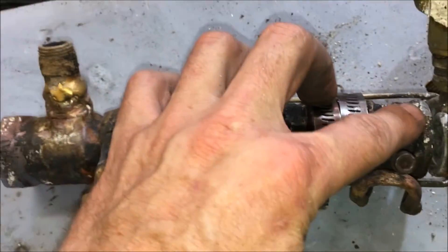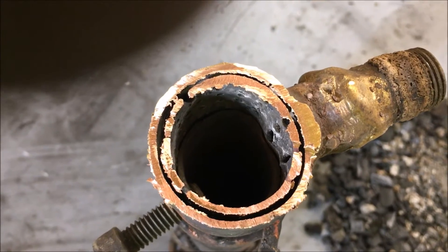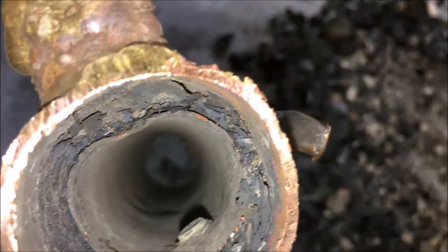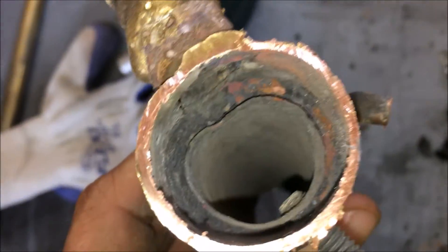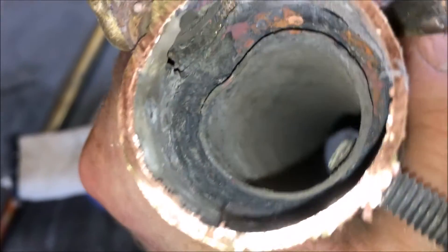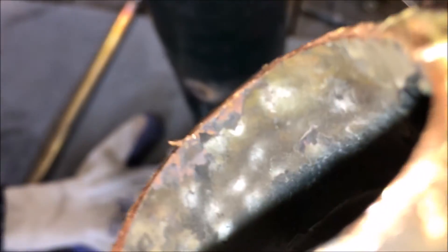We were seeing temperatures down here in the order of 450 degrees with the steam injection. So I've cut the top of this thing off — let's see if I can get this to come out. Look at the size of some of those copper oxide flakes. That is a huge piece of clog. That is a skin of copper oxide that formed on the material from high temperatures. So copper is definitely a no-go. I was expecting the steam to maybe cool it down enough to where I wouldn't reach these temperatures.